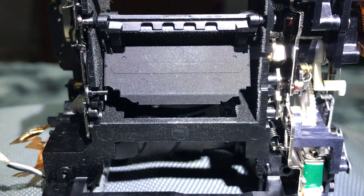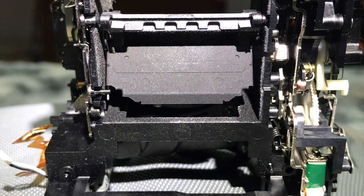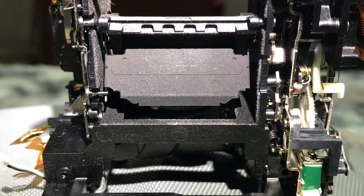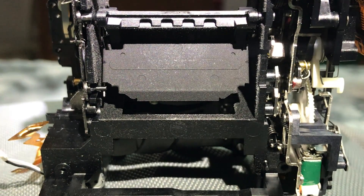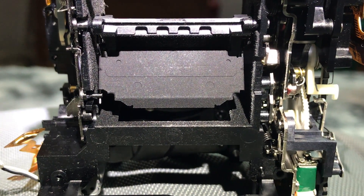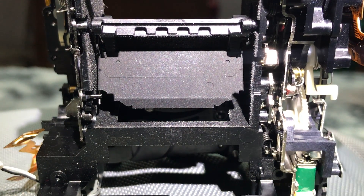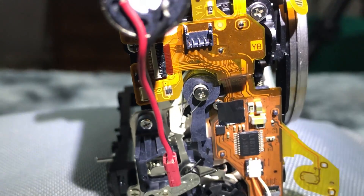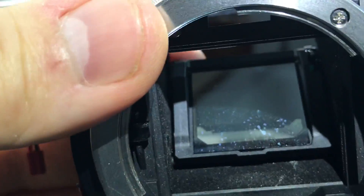This is a design flaw inherent to DSLRs. Like I said, it's not an issue if you're shooting f/2 or f/2.8 and above. But when you're shooting wide and the spring wears out and the mirror doesn't reset to the same spot — yes, folks, this used to be a Nikon D500. Thanks for watching, and I'll catch you later.